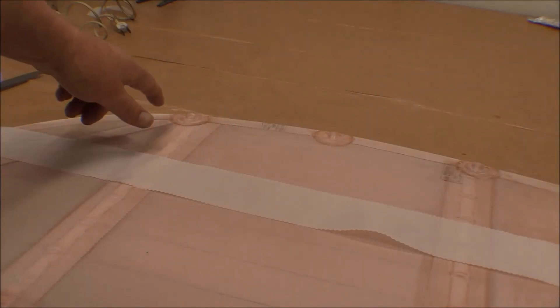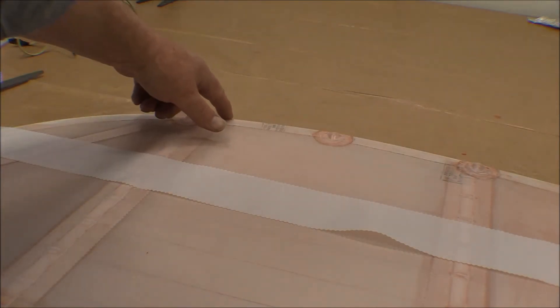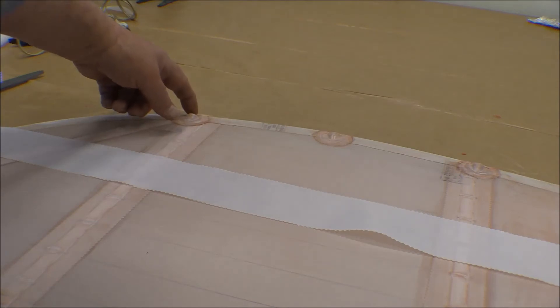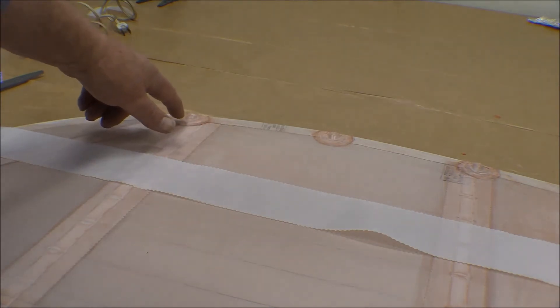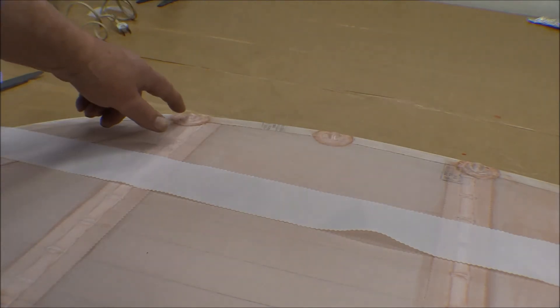Getting this elevator shaped up — I've got my seaplane grommets put on there. They're right down next to this 3/8 inch tube that goes around the trailing edge, and I put the holes as close to that 3/8 inch edge tube as I could get — they're almost right on it. I had to pull them back a little bit to keep the seaplane grommet from overhanging over that. I've got my doilies over the top of that. I like the way they are — they're all at the low points of these bays.